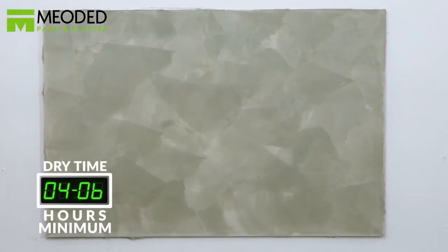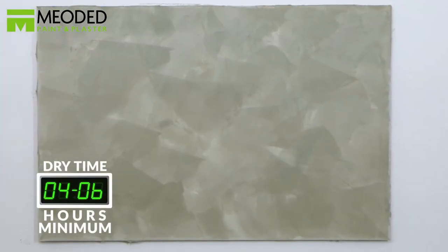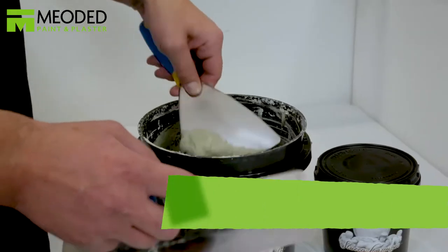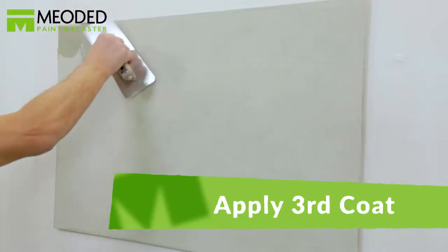Wait a minimum of four to six hours to dry. The Stucco LaMundo dries lighter than the original color, so keep this in mind when choosing colors. And finally, the third coat. Still working in square yards, cover the surface entirely and then smooth out a thin, even third coat.